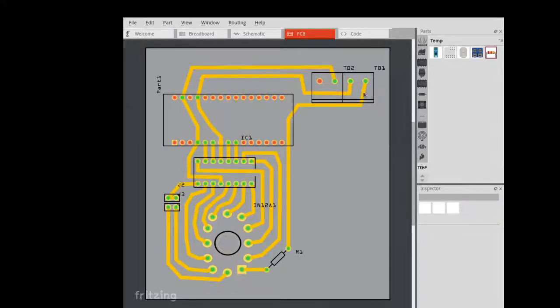On top, we have a power supply unit, and so there's three basic wires over here. One of them is a ground wire, that's this one, and so that ground basically gives a common ground to all the electronics in the microcontroller as well as the IC. There's this one, which is the 5 volt line, and that powers the microcontroller and also provides the power to run this IC. And then there's this high voltage line, this one, which is at 170 volts, that goes directly through this resistor to the anode of the IN12. So that's the entire circuit.